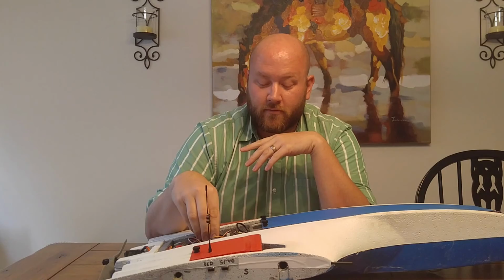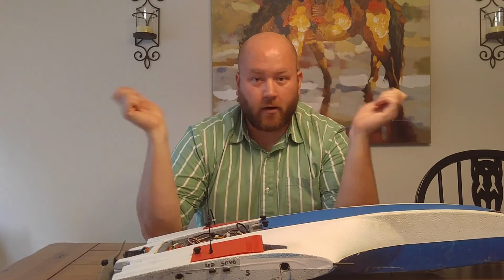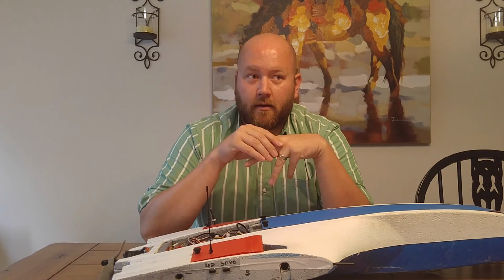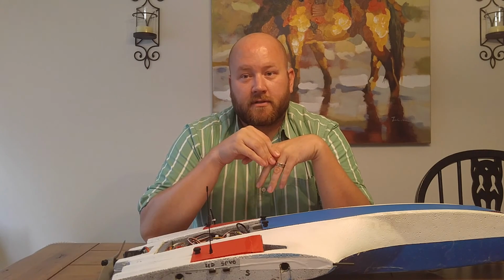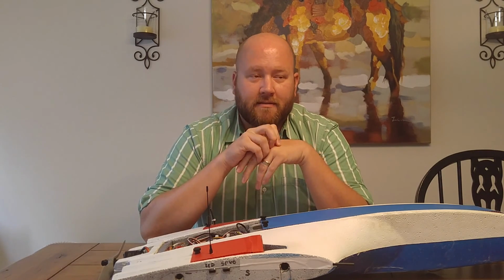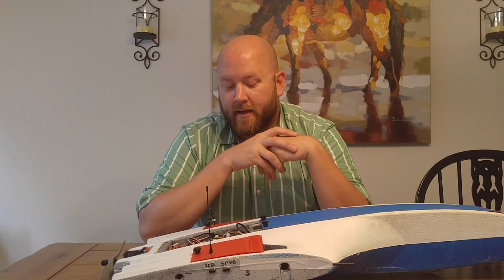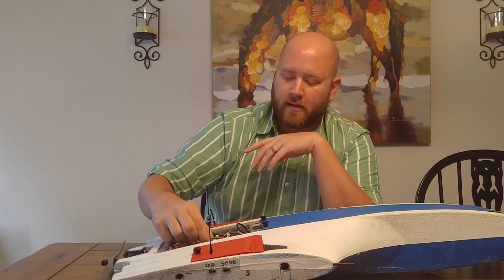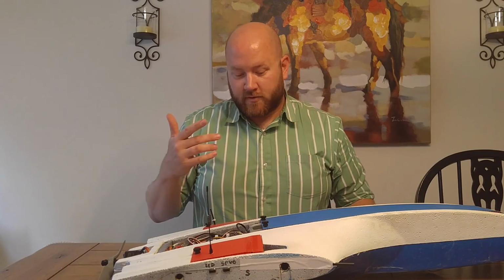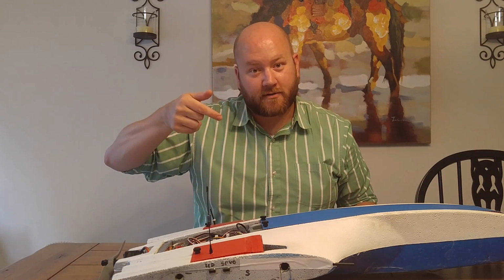Basically, you have to dismount your flight controller, take all the wires out of it, take it out of the plane, and hook it up to a UART. Oh, I'm sorry, that does come with it, in order to do the updates. It's just fairly cumbersome to get all the wiring right. And they switched the layout of their servo leads. On version 1, the signal wire was on top. On version 2, now the ground wire is on top, so it's reversed.